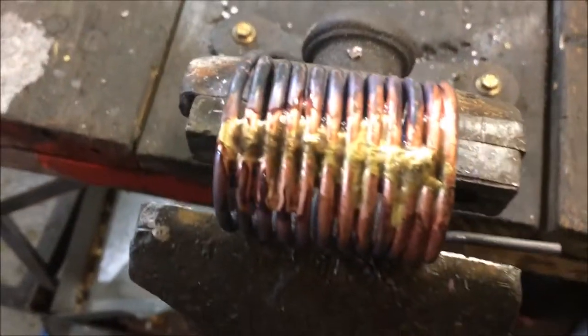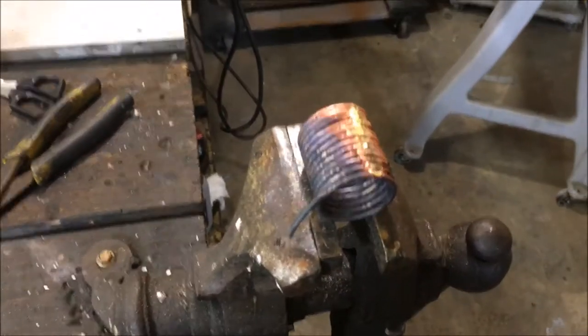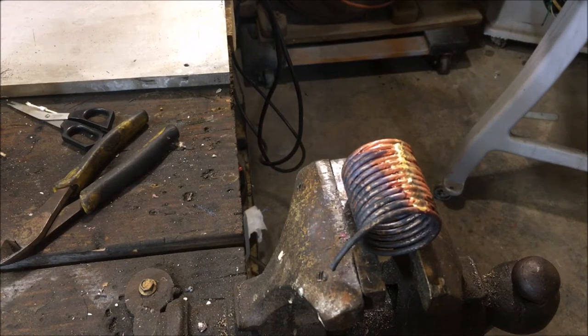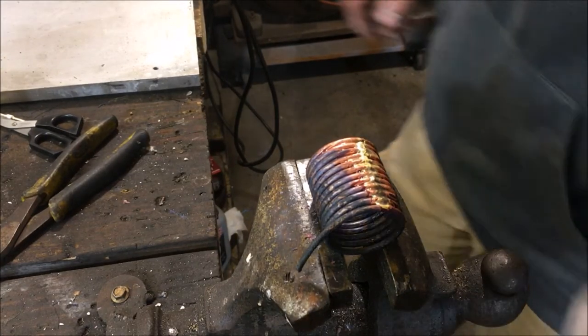This is a quick clip of how to remove brazing flux. We're gonna take a blowtorch and a spray bottle, and we're gonna get this off here as quick as possible. It makes a little bit of a mess, but what's gonna happen is the flux, after the second heat up, is gonna turn into a white powder after it's been sprayed. Then after it's sprayed from that point, it'll start washing off as a dirty water. So here we go.